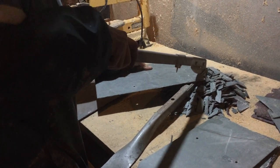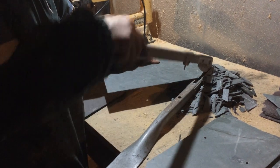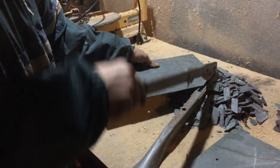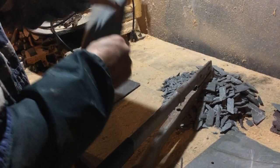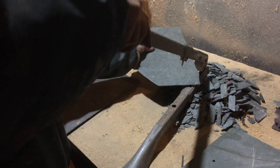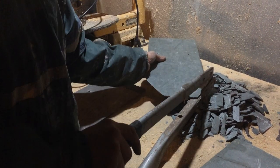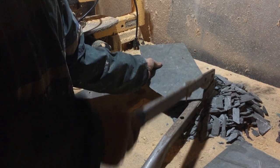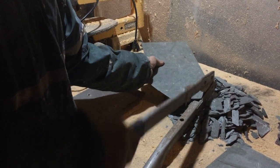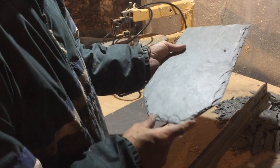Come over here and then come next to the line. Sometimes it'll break off and if you ruin the piece, sometimes I even cut it off and then work my way over. It kind of tells you how that piece of slate is going to cut, because it depends on the grain as to how nicely it's going to cut.